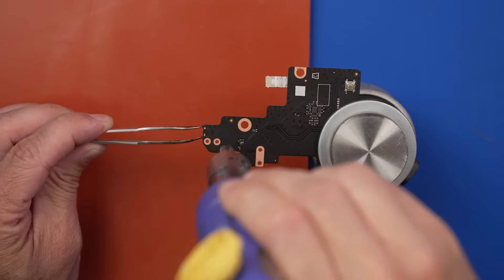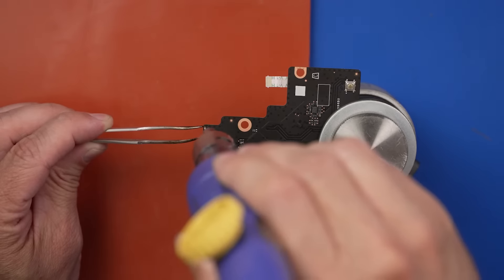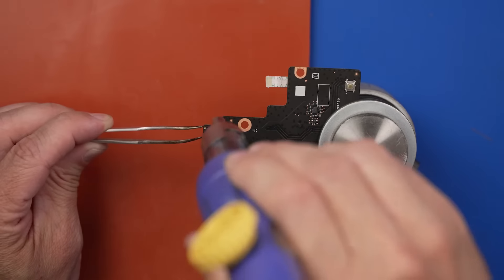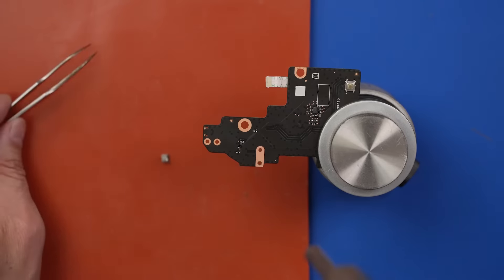I'm heating in large circles to help soak the whole board so we don't get as much localized heat. Too much localized heat can cause the board to delaminate, also known as popcorning. It just pulled right off. So it looks like hopefully this pad and this pad might be okay, but this pad was definitely torn off. We need to get some solder off to really inspect it, so I'm going to use some solder wick to suck up some of that solder and then take a better look.